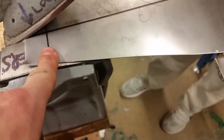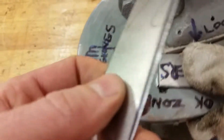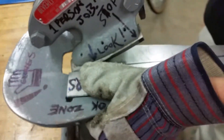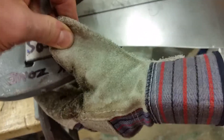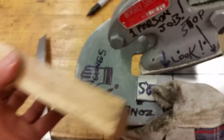Wait, stop. You see how that comes up? That's the only problem — you have to hold down at least from here. You can't let it twist, because then what happens is you're gonna get a jagged edge. There's a little jagged piece right there. You're gonna get an edge that has little curls on it instead of flat. Hard to describe in the video, but — his finger's not in there, that's just extra. You could even use another piece, like a piece of wood as a pusher. Okay, go ahead.